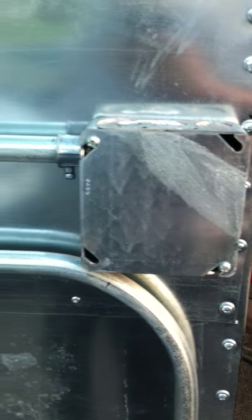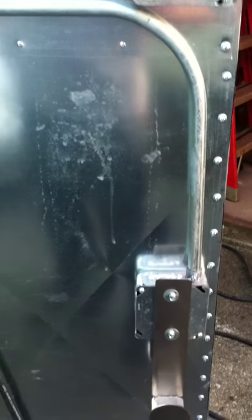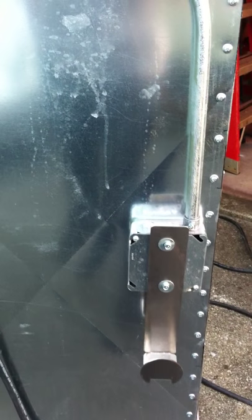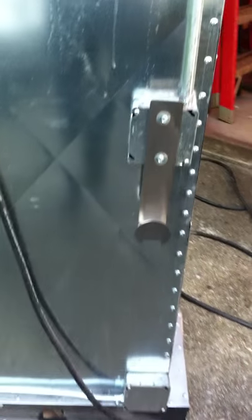This is one of my boxes going to the light inside from my control box. This box is going to my thermocouple inside, and this conduit here is going to my element. I also have conduit inside the wall running to the light, thermocouple, and the element, so I have access panels where I can get to the junction boxes inside that wall.